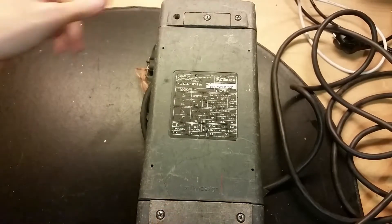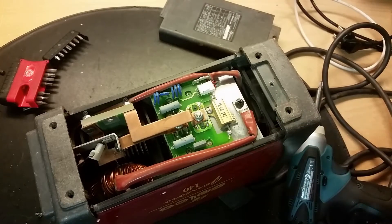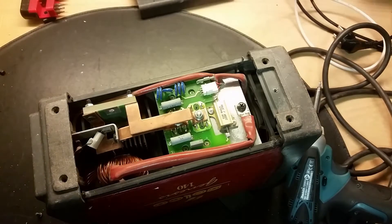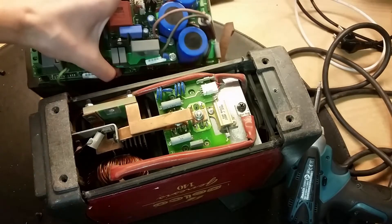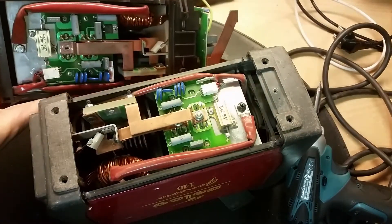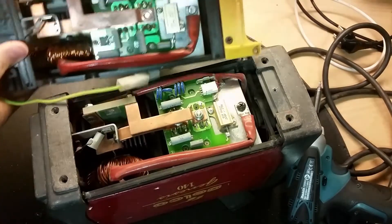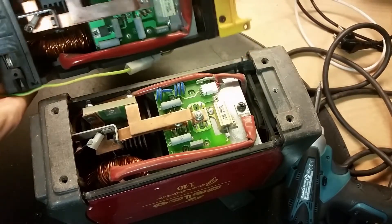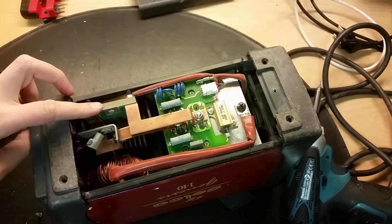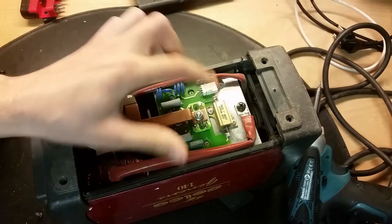Let's remove the screws and see what's inside. Here's the inside - this looks like the rectifier part. Wait, I think I have one of these welders - here's another one, exactly like this one, which was thrown away. The underside is exactly the same. So I have some spare parts here, which is good to know. We got the transformer, which is made out of PCBs, the choke down here, and the rectifier looks good.